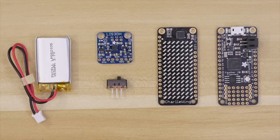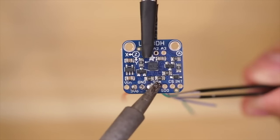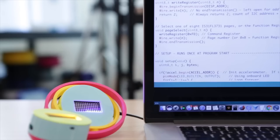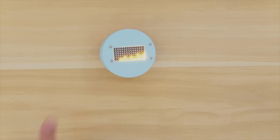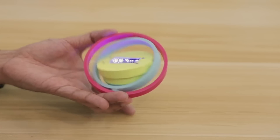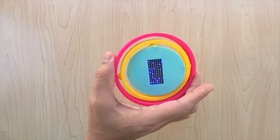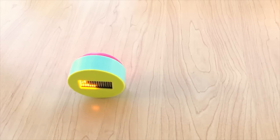This is actually an Adafruit LED matrix board, driven by a Feather M0 board sandwiched behind it, along with an accelerometer breakout board, rechargeable LiPo battery, and a slide switch to turn it on and off. The Feather reads the position of the accelerometer and then runs a little physics simulation to animate the pixels on the LED matrix. Noah and Pedro have included a design for the 3D printed enclosure that allows it to wobble around or even spin inside of a 3D printed gimbal. It's such a fun little project and the parts can all be had for under $50, and even though the 3D printed case really puts a nice polish on this, it would still be fun with just the bare boards.